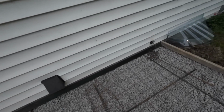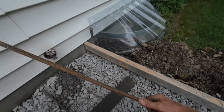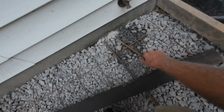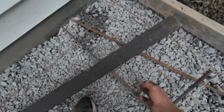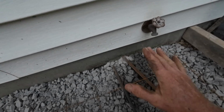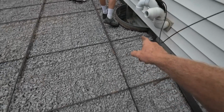So on this construction, you see, I don't like this right here, but we'll adjust it. I want these stubbies. We do short rods like this right here, and I put these underneath our reinforcement. And this stuff gets drilled into that hole. That way we can pick up our reinforcement and these stay on the bottom. The concrete sets on these. It doesn't necessarily wrap around and bond to that. If this concrete needs to heave ever so slightly, we want to allow it. Otherwise you're going to get a crack. So we want that all underneath, right like that. So I'll fix that. That one's good, and so on.